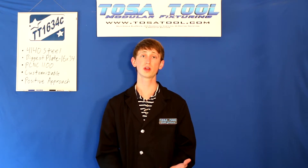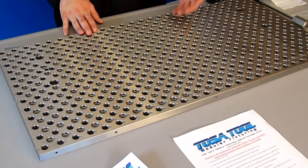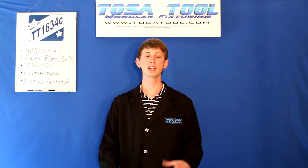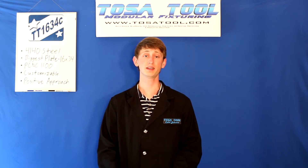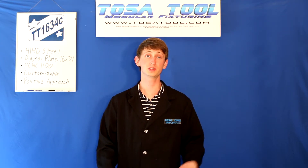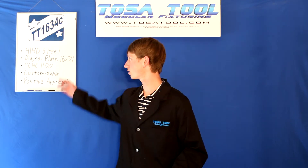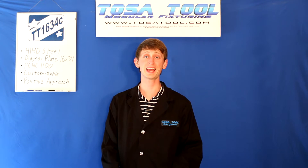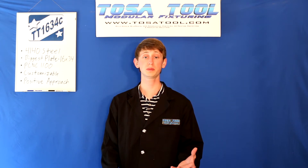If you want, we can send you a program that engraves your workspace outline in the plate — this allows for easy machine setup and shows your travel boundaries. John Saunders from NYC CNC requested a custom plate, and over the next three to four months he and Dan came up with this design. Tormach used to also carry this plate but most people got it from TosaTool anyway. The bolt-down and locating positions make it exclusively for the PCNC 1100, and at 16 by 34 inches it more than triples the accurate workspace of the 1100. If this plate doesn't fit your mill perfectly, we can customize a solution to make it work.